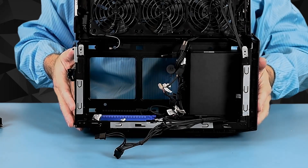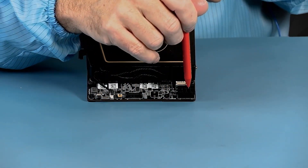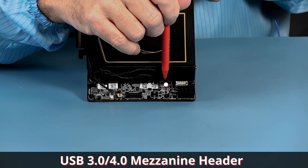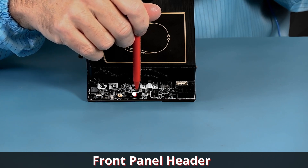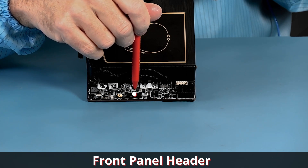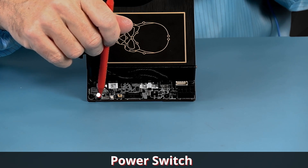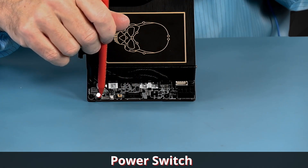So now we have the Eden Bay out, and there is what's left of our Dragon Canyon chassis. Looking at the front edge of the Eden Bay, you can see the eight-pin power connector, the white USB 2.0 mezzanine connector, and the black USB 3.0/4.0 mezzanine connector. Here is the front panel header with additional circuits, going to the power switch on the front as well as the SD card slot. There's also the fan connector, a BIOS reset jumper, and a power switch. The unit can be operated on its own by plugging in 12-volt power and using the power switch.